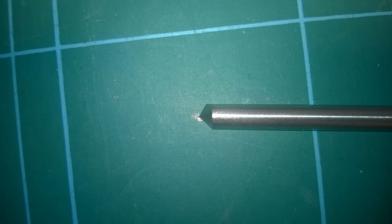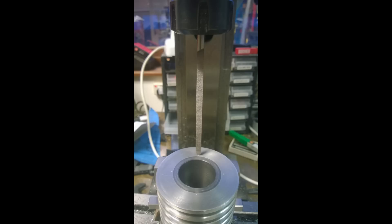So why do we use a D-bit? If you want to cut very long, small diameter straight holes, then you really want to use a D-bit. D-bits are stiffer because there's literally more material than your standard helical drill. This one is to do the 5mm or 5.1mm hole for the head bolts that go from the head straight through the cylinder to the actual engine cases.